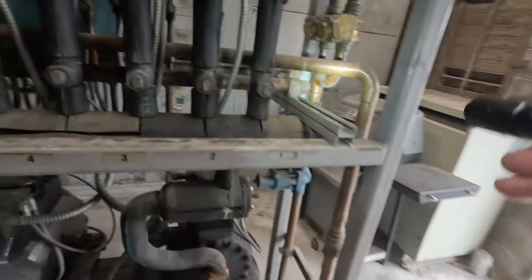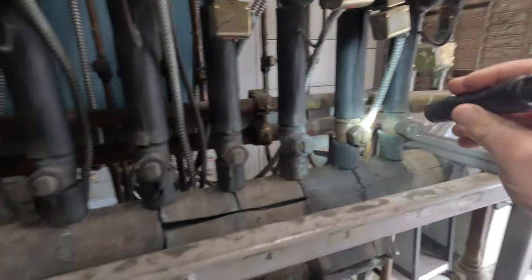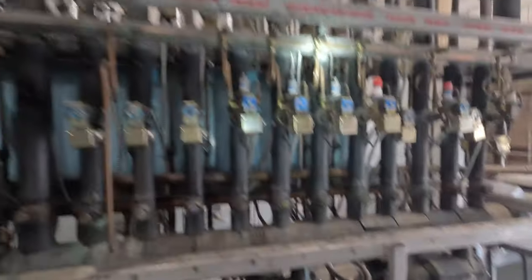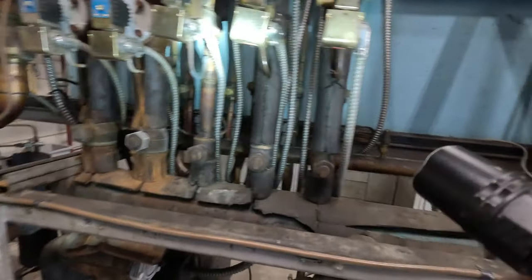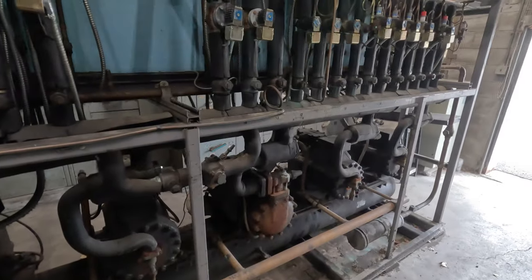You can see that comes up, dumps into there. That's your liquid manifold that then sends on out to the cases. You've got solenoids there on the liquids, and you also have suction stops, which is kind of interesting that you'd want to trap your refrigerant out there. I don't understand that, but I'm newer — I would think you'd want to bring it back. That way, you're not having to come up with more refrigerant. Of course, when this was built, the refrigerant was cheap.